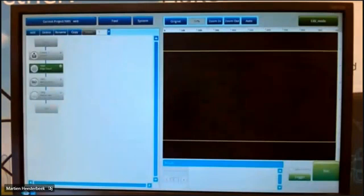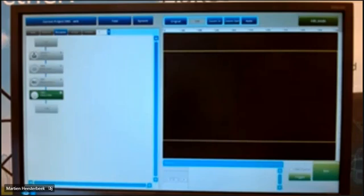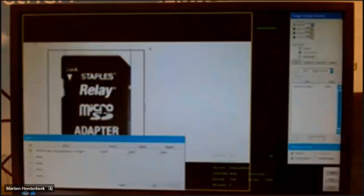And I'm only setting up the status in this case. In the edge count function, I can only check on the number of edges, and I can check if the number of edges is okay or not. I want to show you only the number of edges because if I go now back to run, I see automatically it is finding 2 edges, no more.